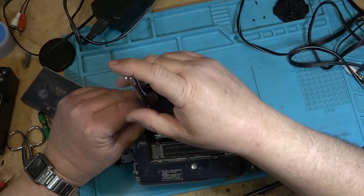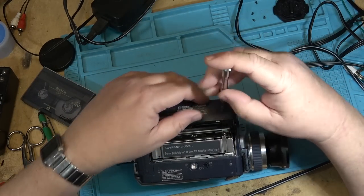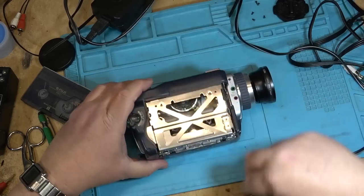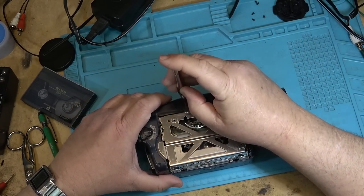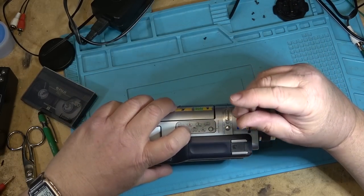I'm also going to do the standard problems that happen on these, even though it hasn't happened yet. The edge connectors cause a lot of problems on these cameras, and that's one of the major causes of intermittent problems. We've gone through that before on other ones. I'm going to make sure that that's not going to cause a problem on this one,